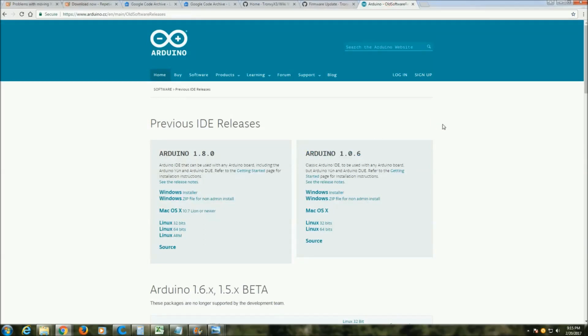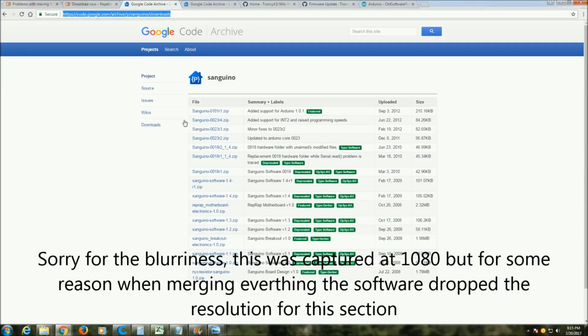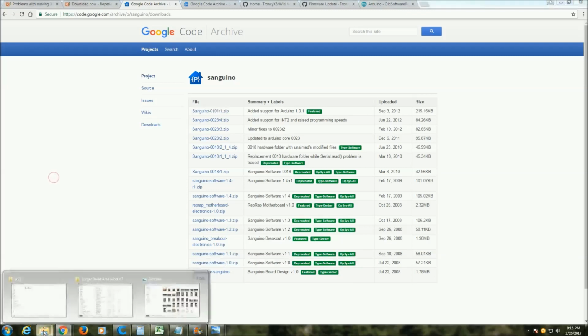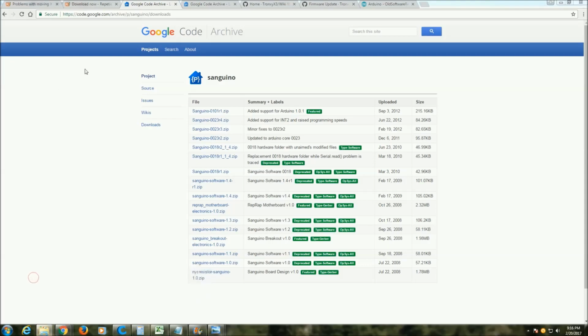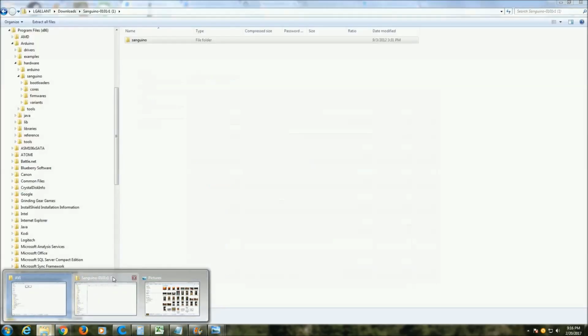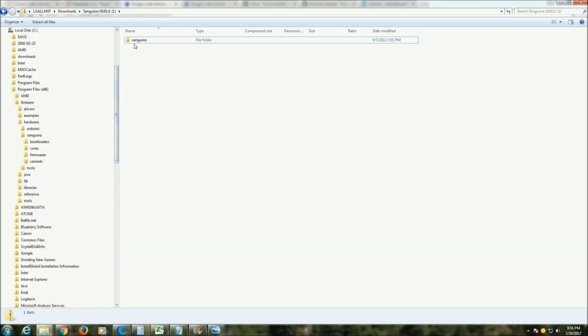The second step, once that's done, is you're going to take this link that will be in the description, and download this version of Sanguino. Once you've downloaded the Sanguino zip file, you're going to go to your downloads folder, open the zip file, and you're going to have this folder inside. What you want to do is copy it into the hardware folder